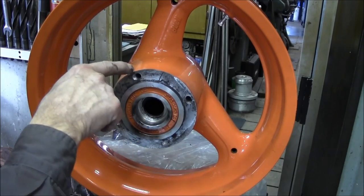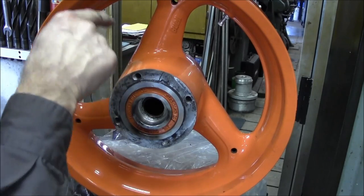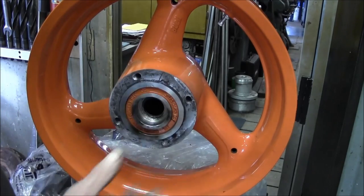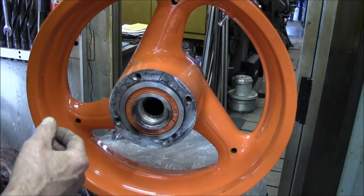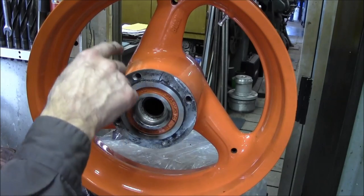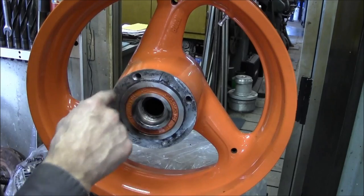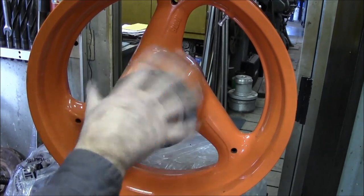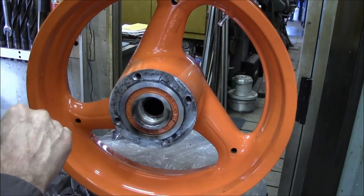The only way to really get in here is to go ahead and mill out a pocket in here, backfill it, and then refinish that surface right there. So we'd be wasting out the paint job on these things at minimum. And this would be about a full day's job to go in here and remove the material, clean it up, weld it up. And this face ain't the best. This face has been galled as well, and this register is wasted around here.